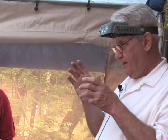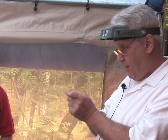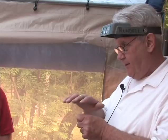and then I'm going to take the sheet gold and pick it up with some tape, a couple of layers of tape. I'm going to put it where I want it and tape it down. This piece will be larger than the scroll that I'm trying to damascene. And I usually use an extra layer of tape.